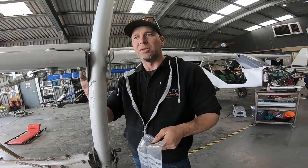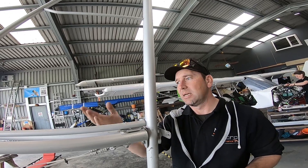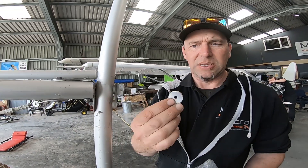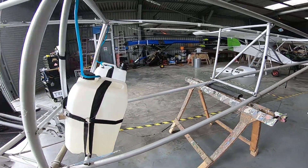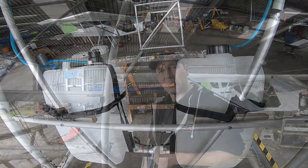When we were thinking about the other job, we also need to put a new skin on this. It's going to be easier to take the whole thing off, reskin it, and do it that way. So it means we can replace the old nylon washers with new aluminium washers. Whilst we're doing some jobs, it's easier to do others. We're going to brace the tail because you don't want to be leaving these fuselage tubes just hanging, and then I can remove the entire stabiliser — it'll be a lot easier to reskin. We can put back much better saddle washers to give it more longevity.